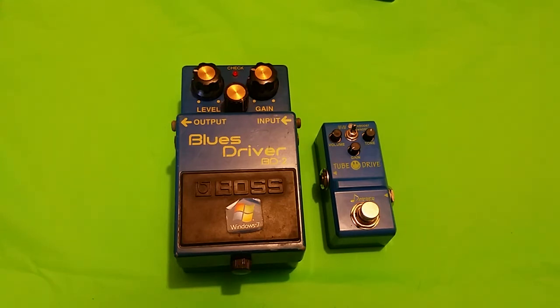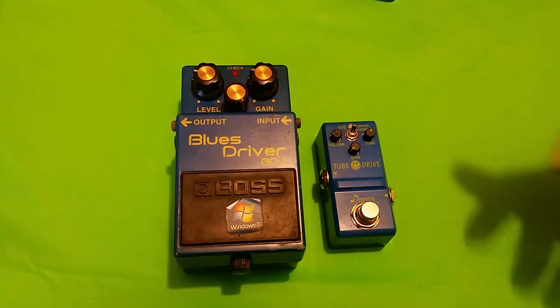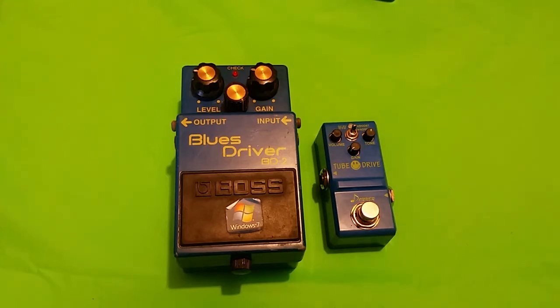So for Donner, I say you definitely need a better voicing. You definitely need more controllable settings in the boost mode to keep it from sucking all the tone out whenever the gain is turned up. And you need a better volume control in the boost mode with more room to finely adjust the lower volumes. And you need a better power jack so it doesn't fail in the middle of a show. I would suggest adjusting the volume and the gain knobs to only allow 70% of the current maximum levels when they're turned up fully. That way you have more room on the bottom end of the sweep to finely adjust things.